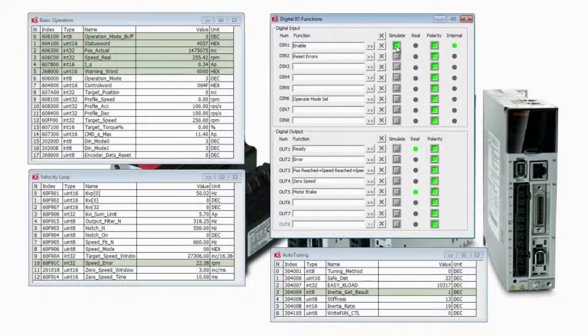When it overshoots, I should expect it to be above 250, because I'm targeting 250. And then when it drops down to about 240, it should overshoot again above 250 — and that's what I am getting. It is operating fairly smoothly. Adding another 5 Hz — it's much less vibratory now, but it is staying a little bit below that 250 range, now a little bit above, because the KVI is not in there.